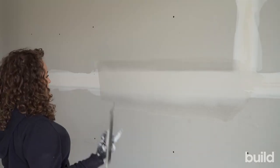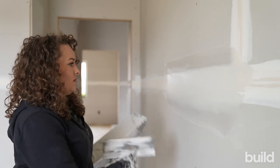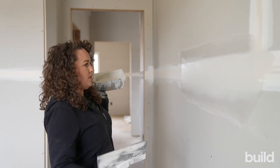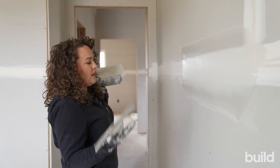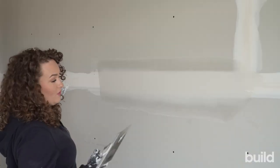I'm going to have another coat coming on top of that. If you want, you can even go a little bit tighter — we like to run our flats really tight, actually. Right there that's about perfect. That allows for the mud to dry, it allows for another coat, it allows for some shrinkage, it also just looks nice, and then it's set up for the next coat and the coat after that.